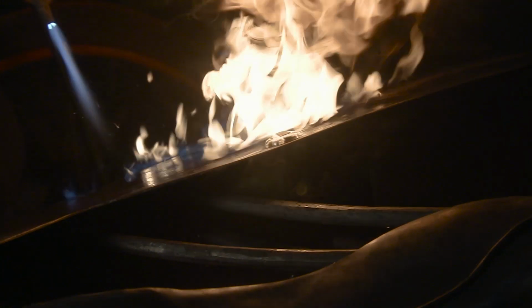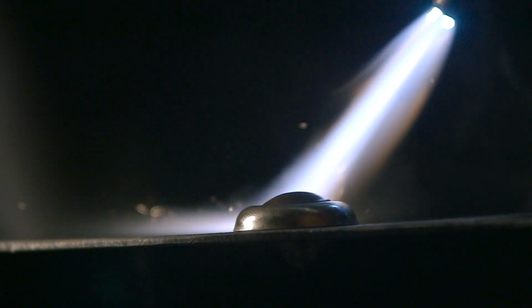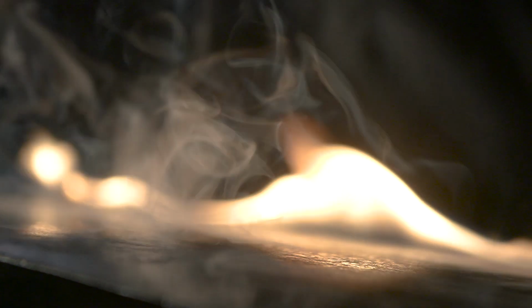Bill uses an old technique that we did when we used to make a lot of armor. He's going to take WD-40 and spray it on the surface as he uses a torch to heat it. That's going to blue the surface. It retains a very permanent color like this.